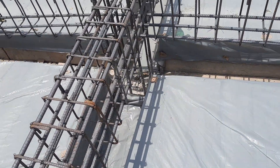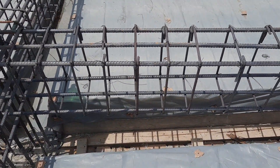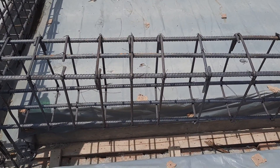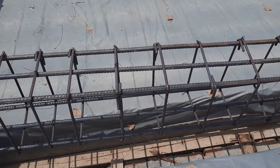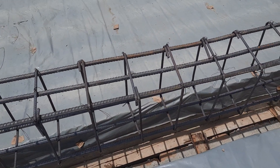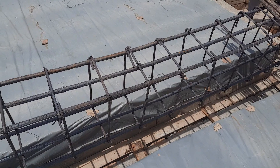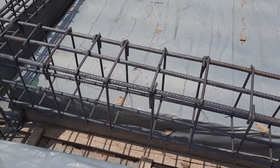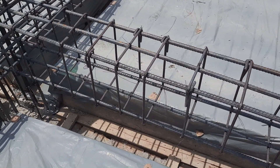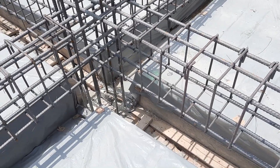This is not the proper design for a cantilever beam — only side bars are provided. This is a simply supported beam: 6 steel rods, three at the bottom and three at the top, diameter 16 millimeter. Stirrup diameter is 8 millimeter with spacing of 8 inches. Hooks are bent at 90 degrees as well — same mistake. For a cantilever beam, we should use the proper steel structural design.